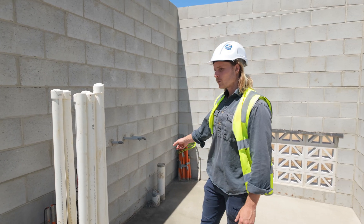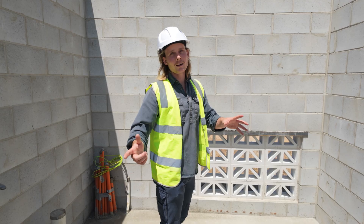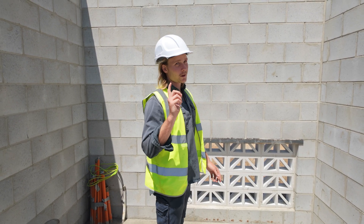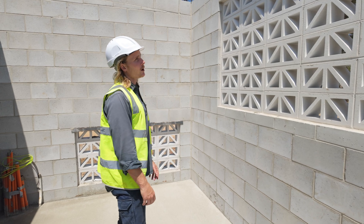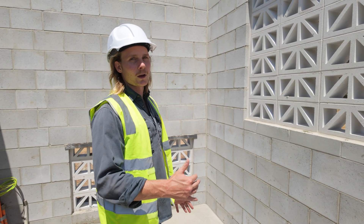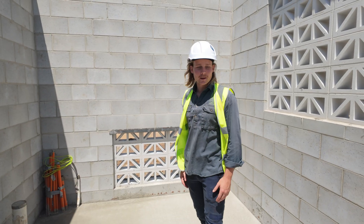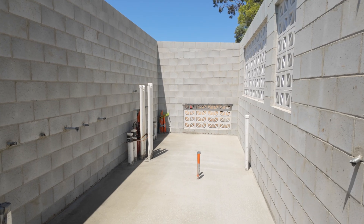The main system is all going to sit here, and we've got the backwash points. We're going to have big heaters in here, and I worked with Hutchies to make sure we can't just enclose the whole room. The problem is the heaters discharge cold air, and the room would just turn into a cold room once the roof is on. So we need crossflow ventilation — we've put breeze blocks here and here. The heater sits here and discharges straight out those breeze blocks, allowing fresh air to flow through and air out the pump room. When you've got an enclosed plant room, breeze blocks are an awesome addition — you still get the block look but get ventilation through it. All the power is there: we've worked with the Sparky to make sure we've got the right GPOs, voltages, and three-phase supply on this side.